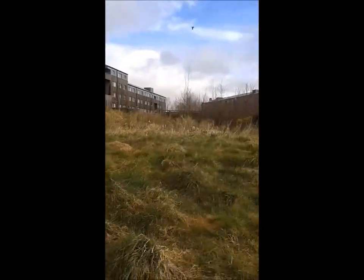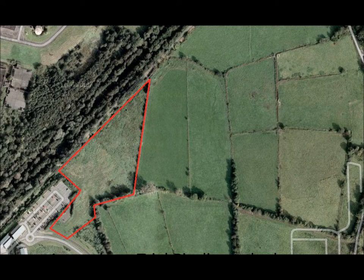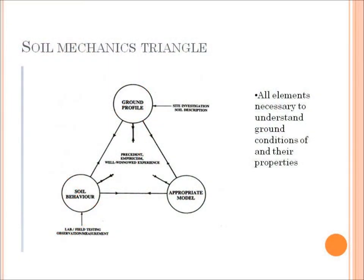During our trial cutting, the berm is manufactured in successively compacted layers by a sheep's foot roller. Then it is backfilled from the excavation up to make up the levels. The water side slope is at a ratio of 3:1 to help prevent erosion.